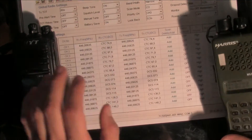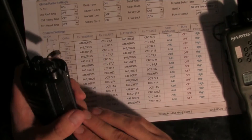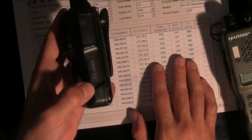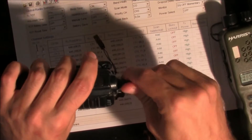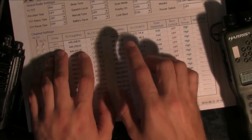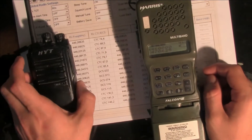As you can see, this radio doesn't have front panel programming — it's programmed only by computer. I've downloaded the configuration via the communication port, and here I've got all the frequencies programmed inside. This is a PMR radio, but not a standard PMR radio with a fixed antenna. For this test, we are going to program two frequencies — the first two channels with different CTCSS tones — and make sure we are able to communicate in both directions.